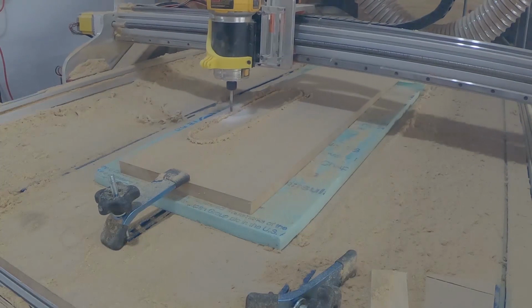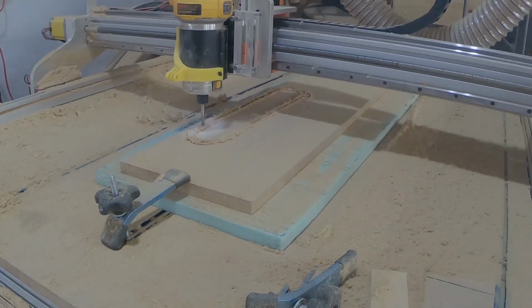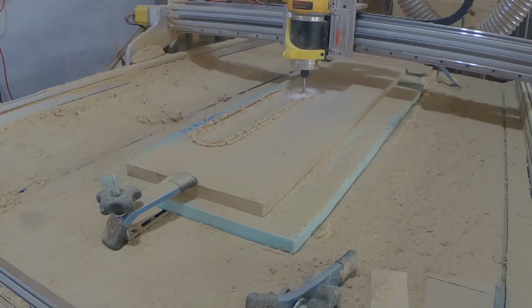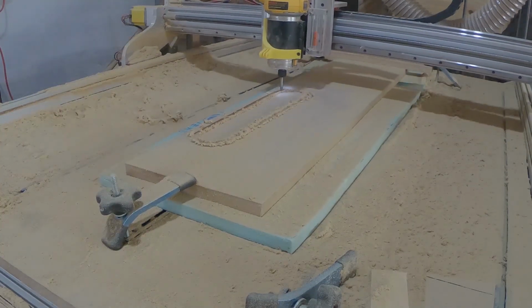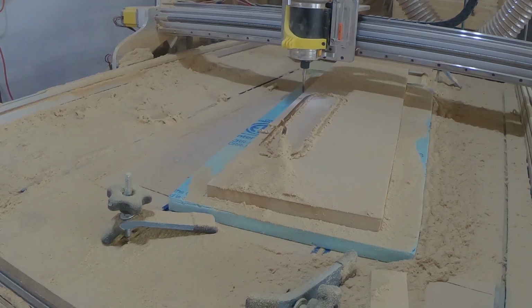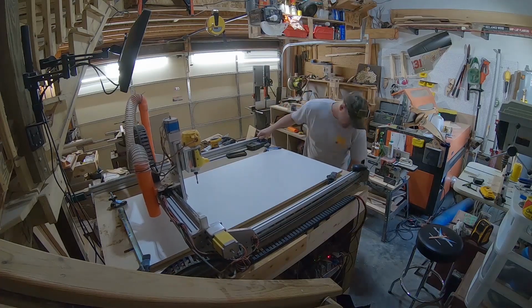I thought that having the 2 clamps on the back and the one in the front would be okay, but I guess not. This is sped up, so what I didn't see was the actual movement that was going on until it was too late. Wait for it. Now this is bad because not only does it ruin your part, it could also break your bit. And that's, you know, $35 down the drain, but it's also dangerous because it's not good to have a piece of metal flying across a room like a bullet.